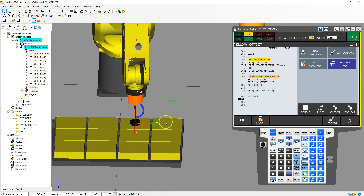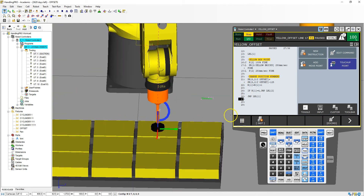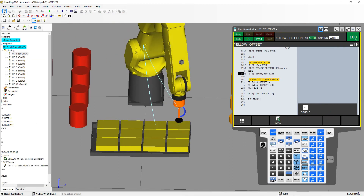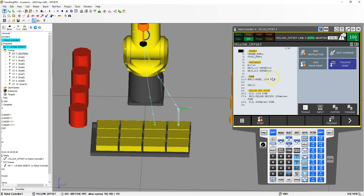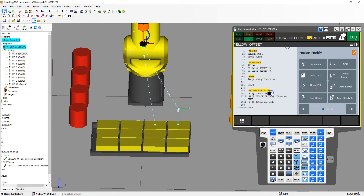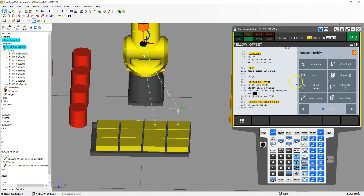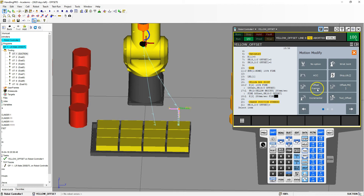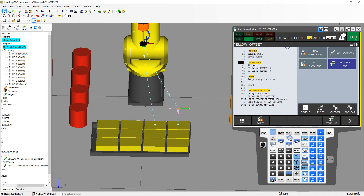Right now we're only going down the row — just going down the row right here. Let's see how this runs. It keeps going up and down because we did not add the offset to our points here. So let's go back in here and add that offset. No option — we're going to do offset point register number 6. And then right here, offset point register number 6. And then offset point register number 6 there as well. Now that we have the offsets on the actual points, we can actually run this program.